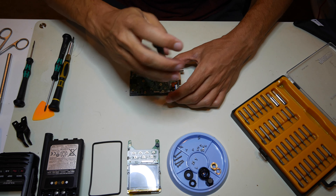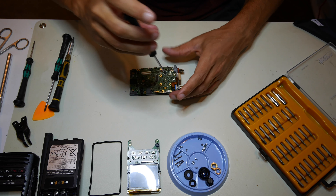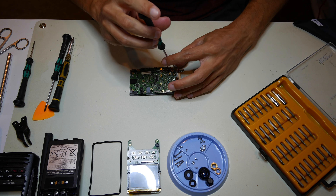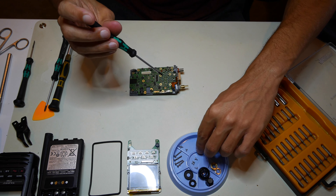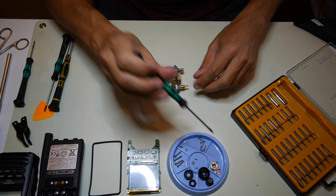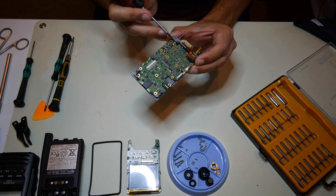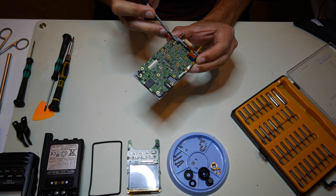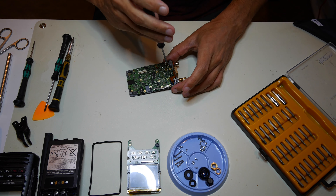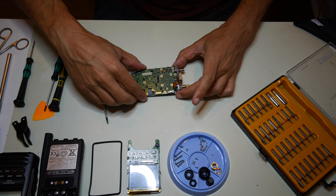I haven't monitored the bus traffic on this radio like I did on the TH-D74. One interesting thing: you can capture the firmware off this radio — technically while it's being loaded over USB. I've done it using some software, and I'll show how on the wiki. It seems to work for both the FT2D and FT3D with no problem and just requires a little post-processing on the captured file. Another cool thing: the antenna connector here actually screws down, whereas on the Kenwood it was a pin I had to desolder, which was much tougher. I just like the Yaesu design better for serviceability and overall fewer components.